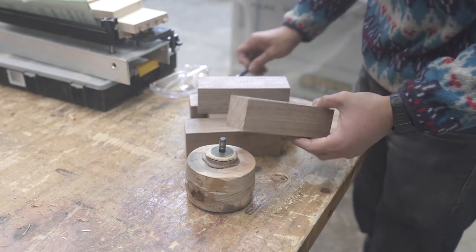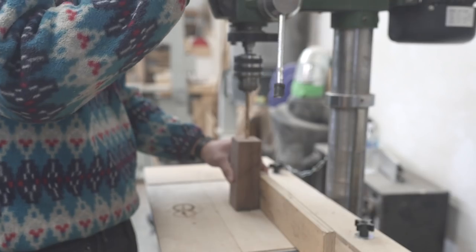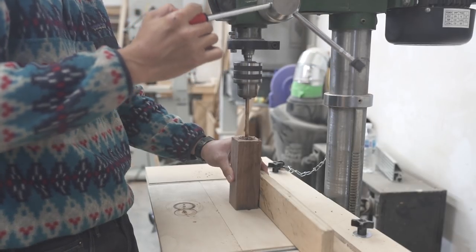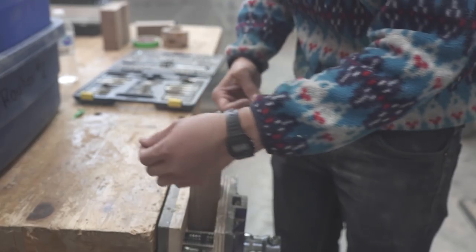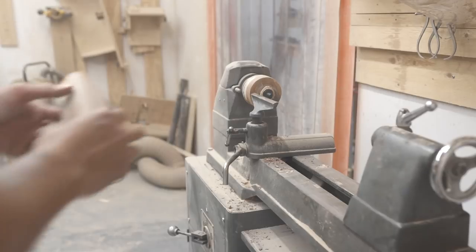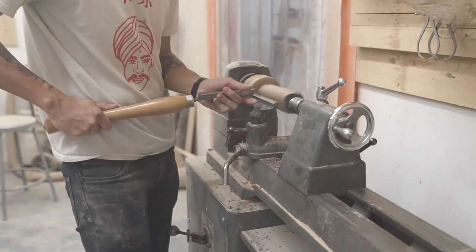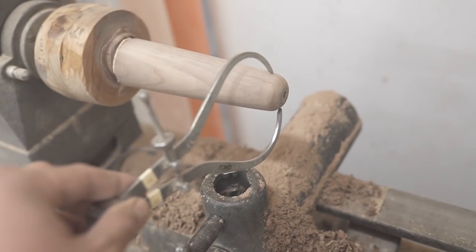For the legs, I wanted something that splayed and also tapered, and I wanted to use walnut to match the walnut veneer of the box. I started with four pieces of two inch by two inch by six inch long legs. After finding the center and drilling out a five-sixteenth inch hole, I was able to tap and die a three-eighth inch thread into it. I have a jig for the lathe that I use for my tampers and things like that, and I was essentially able to attach the leg to the jig and turn it on the lathe. After turning all four, I used calipers to ensure they were approximately the same size.